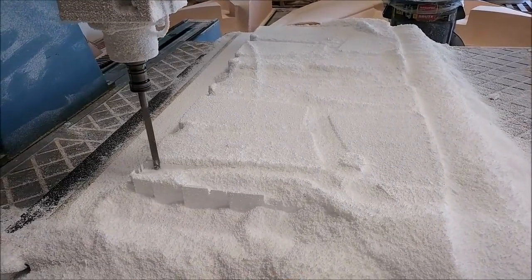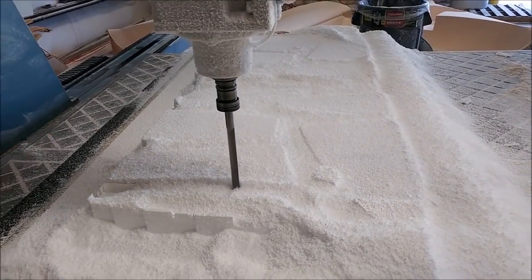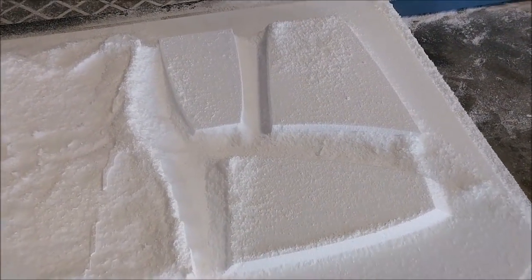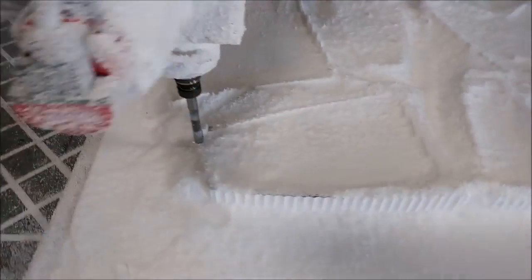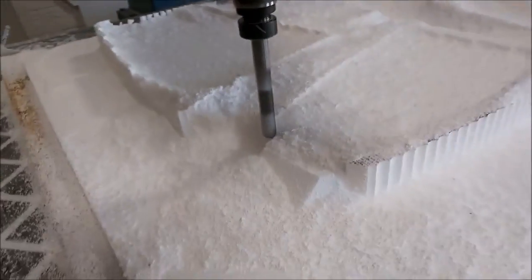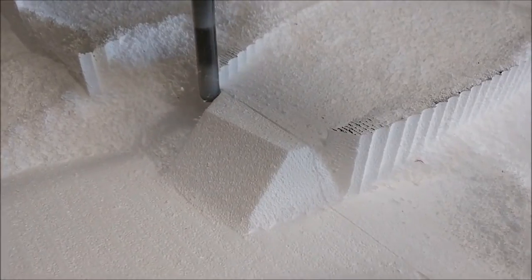Here is the first of those up on the mill, already with the roughing cut done around the flange and cutting in between some of them, just doing the face cut on the top. A little bit further along the ball mill is being used to go around the edges, giving a nice radius not only on the top but on the bottom transition to the flat flange. That one actually didn't take too long — only a couple of hours to finish off. We'll be doing quite a few of those when we do the ribs for the wings as well. Anyway, that's our update for this week — thanks for watching.